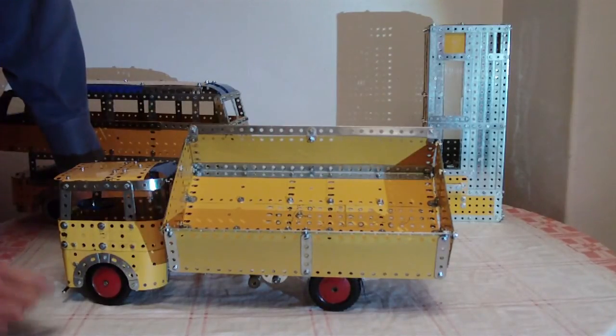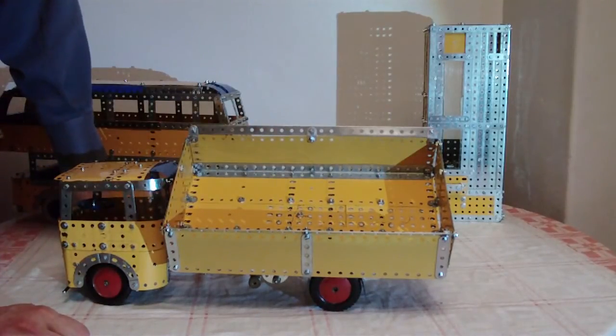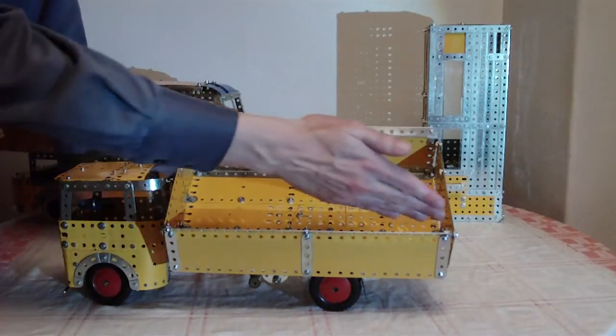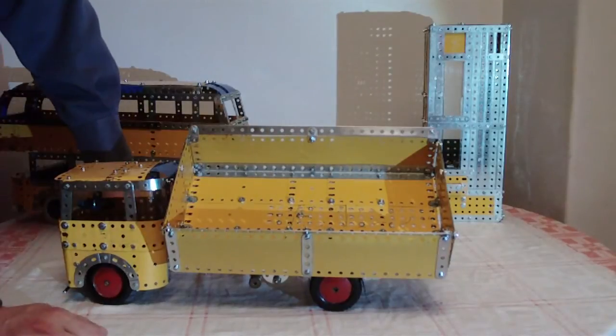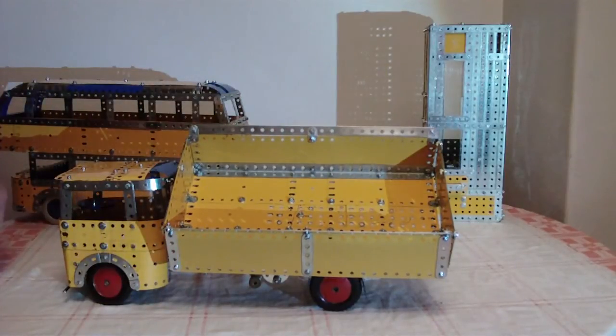One thing I had to think about was underneath this bolt here there's a small angle bracket which goes to the lifting mechanism. In the manual it's shown as being one lower down, so it's nearer the pivot point of the back, and if it's there, I was getting a lot of trouble with cogs slipping under the load and even cogs disengaging. Put it one higher up and it seems to work a lot better. However, it means it doesn't tip quite so much. All in all, it's an excellent model, enjoyable to build and enjoyable to operate.